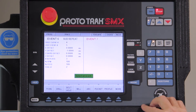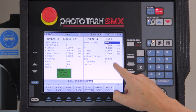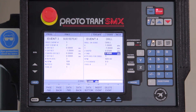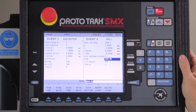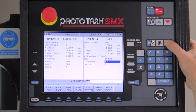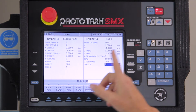I'm going to go back a couple pages and pull up my first new hole that's got tool number two, because I want to make a couple slight changes. The first change I want to make is that I want to make that Z depth actually be minus 350 thousandths. And I want to make it do it in three pecks, and I want to slow down the RPM a little bit and speed up the feed rate a little bit. Because when I use copy it makes exact same programs, I still only have to change event number four — event five and six I repeat so they'll automatically change with it.